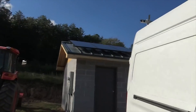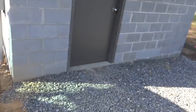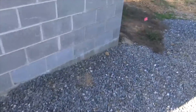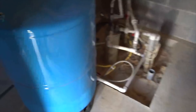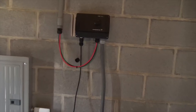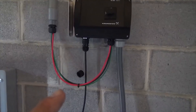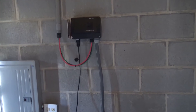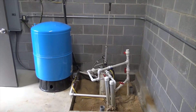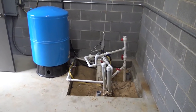Okay folks, wrapping up — this is a quick one-day job: get panels on the roof and pump water. The pumps were already in, but we had to move bladder tanks and plumbing from the house, which is under construction, up here into this nice new pump house. We added the Grundfos IO 101 transfer switch, which is a great way to switch from grid or generator to run a pump, or you can use solar. Right now we're on solar, pumping and filling a cistern for the farm to gravity flow the entire place.